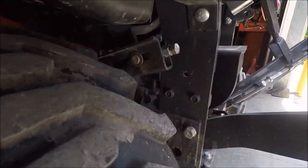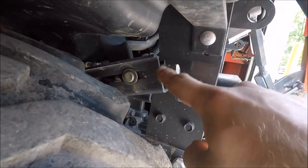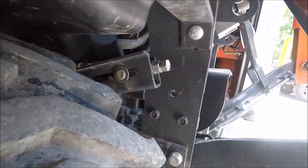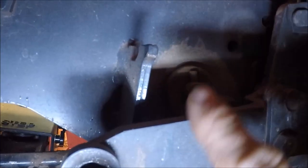So we'll come to the left rear of the tractor, and there's a linkage with an adjustment bolt and a lock nut on it. We're still on the left side of the tractor, underneath here at the floorboard. You can see the linkage that raises the mower, and this is the stopper that's welded onto the frame. You raise the deck up, the linkage will go up and contact this stopper.